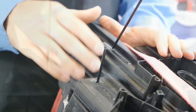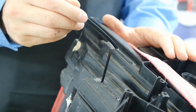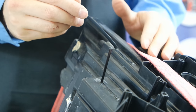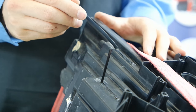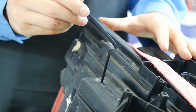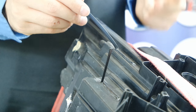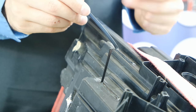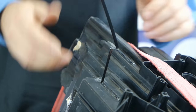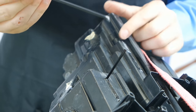I have left a strip to show you how it all holds together. For beginners, it is advisable to do some tests beforehand. Use various materials, test, and wait some time to see if it holds as strong as you expected and there are no problems whatsoever. So it holds very well. With PPU, after welding and full cooling, not like here where it is still slightly warm, check whether it holds very well, as you can see.